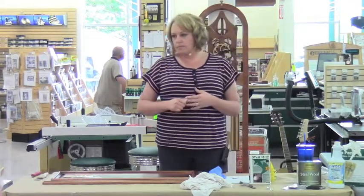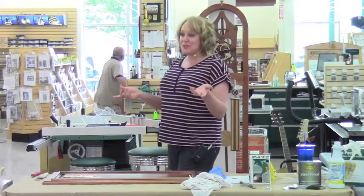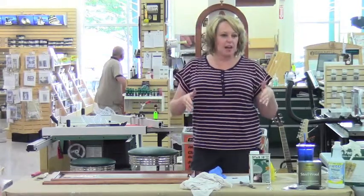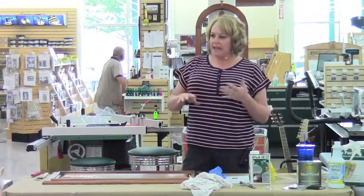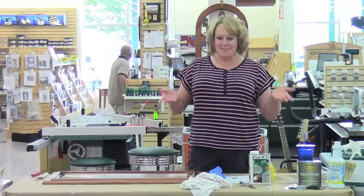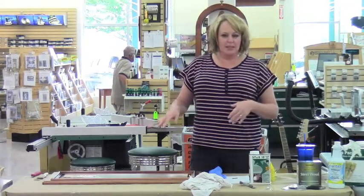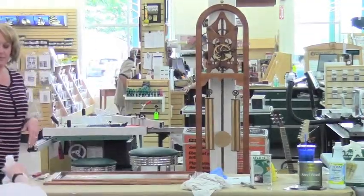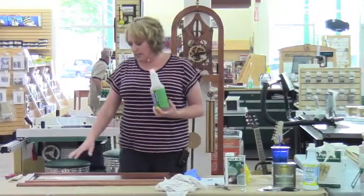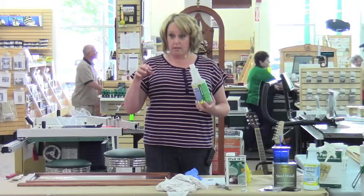Does it have a temperature range that works best? I used it in the garage in the summertime and it worked fine. This week I used it on a little antique chair that had been stained, clear coated, and then painted over multiple times — coat after coat. I put the Soy Gel on, and it says to start checking in 30 minutes. After 30 minutes it wasn't doing much on the chair, and on this cabinet it's been about 30 minutes and it's not bubbling yet. It does start to bubble, peel, and crinkle in the gel as it works, so check every 30 minutes. I put it on the chair after dinner and left it until the next morning — the beauty is it does not dry out. It was still moist and ready to be scraped off.